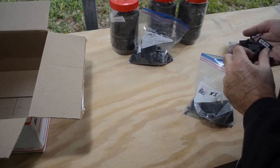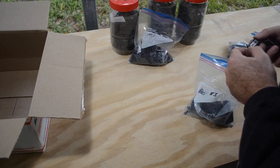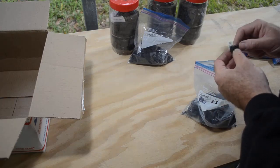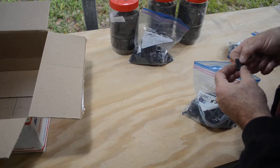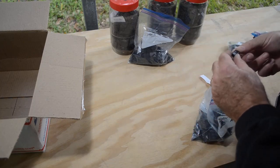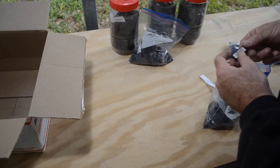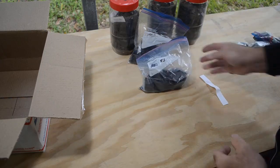More flat packs. It says ROM but it's not a ceramic — it's plastic, it's probably a PROM. We got some DIP chips, and I wouldn't be surprised if some of these are magnetics. I'll bet these are not really IC chips — yeah, I can see where the epoxy is broken on the bottom. These have got transformers in them, so these are not actually IC chips. I'll separate them out when I'm ready to process so I don't contaminate everything with iron and extra copper.